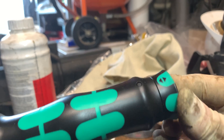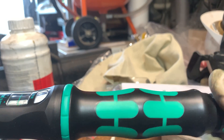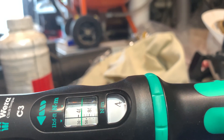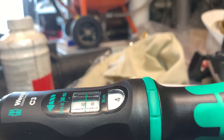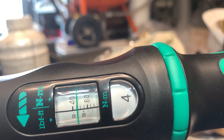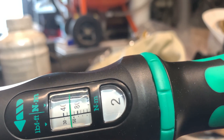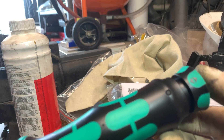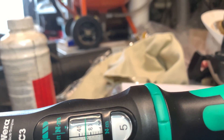We've released the tab on the bottom — that locks the handle to prevent you from turning it when you're actually using it. Pop the end out so you can turn the handle. The most significant figures in the display are Newton meters. The big display goes from 40 to 80 in 10 Newton meter increments. So if you go to 60, that's set to 60. If you want 65 Newton meters, carry on until you see 5 in the display below the main window — that would be set to 65 Newton meters. Press the tab at the bottom and away you go. I actually want 65 Newton meters coincidentally on my truck for a little job I'm doing now.